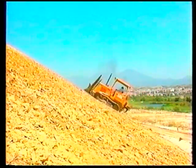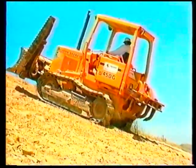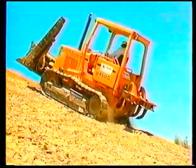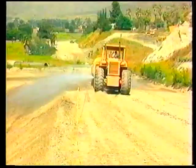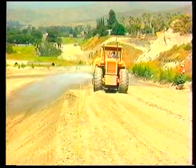This is a procedure that's done to a slope to help seal in moisture, eliminate erosion, and develop ground surface compaction. Track walking isn't always mandatory. The slopes on the project may be required to be vibrated and grid rolled. Moisten the slope before you begin. Remember, it should be damp, not wet.